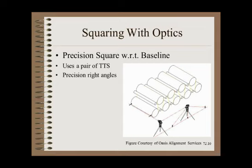One serious limitation of optics is that line of sight on either the 3 o'clock or 9 o'clock positions is required to square. The sight level is not so limiting, but still requires line of sight of both ends of a roller from some location. Machine designers should take line of sight into account when designing frames and guards to allow for easy optical alignment.